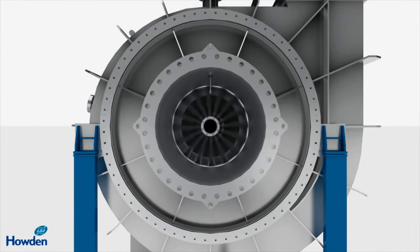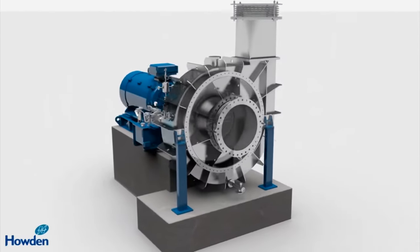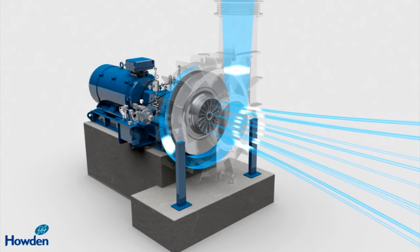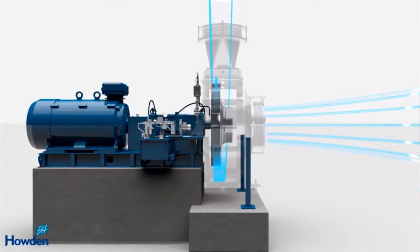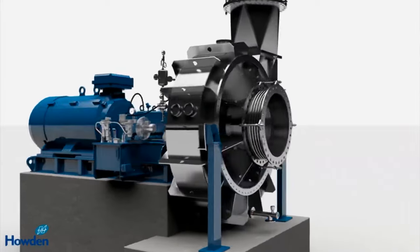The EXVAL unit is an extremely robust, gas-tight turbofan, ideally suited to the pressures, temperatures and volumes of the MVC evaporation process. At its heart is an ultra-high speed impeller with a tip velocity of over 1000 km per hour — faster than the speed of a jet airliner. The EXVAL rotor probably has the highest tip velocity of any welded impeller ever manufactured.